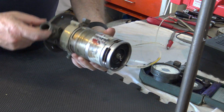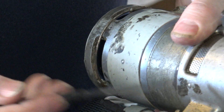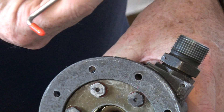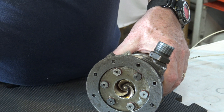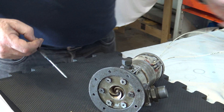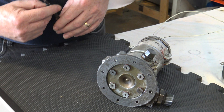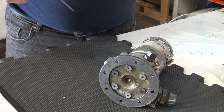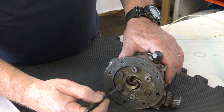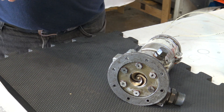This is the actual fuel pump here. We've got the impeller driven by this motor — the fuel goes in there and blows out in that direction. These are 12 volt and 24 volt. Why does it take a certain time to build up speed? Because of the inertia — it's quite a heavy armature in there, and you've got a carbon thrust bearing as well, which creates drag. You've got to overcome the initial friction.